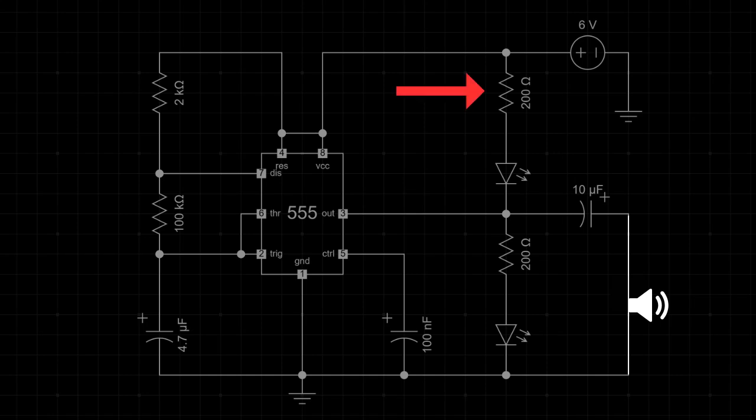There is a 200 ohms resistor from the output (pin 3), then a 10 microfarad capacitor goes to ground in series with another 200 ohms resistor. The circuit sends pulses through the capacitor to the speaker. The capacitor blocks any DC component, so you only get pulses or changes in voltage. Because a small speaker is connected, we hear a tick or pop once each cycle.